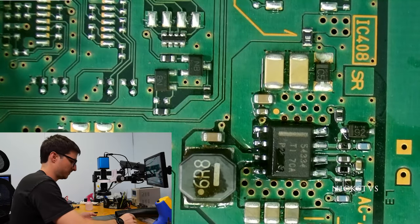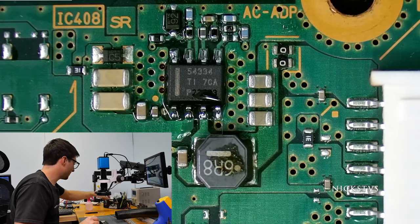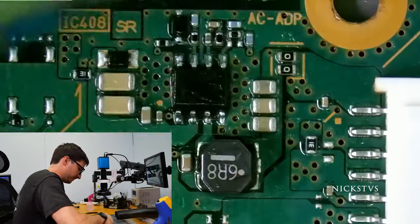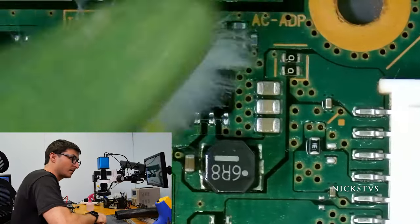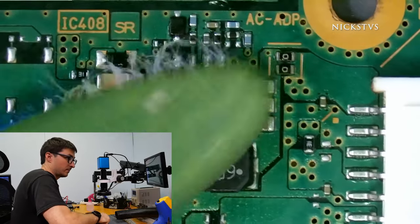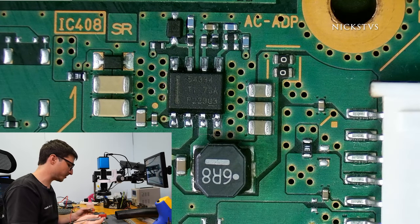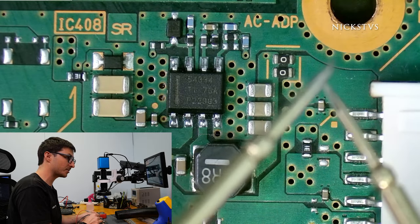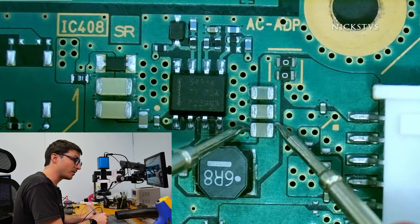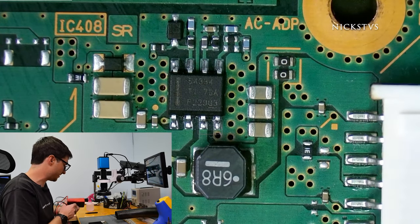I think that should be good. I'm going to do a little bit of cleanup, using 99.99% alcohol here — it should all evaporate in a second. Now that the chip is installed we're going to do another short check. In beep mode, when my leads touch that's a short and it beeps. Checking those capacitors — we do not have a short anymore. The short is gone; we have taken care of the issue and we can plug the board back into the TV.